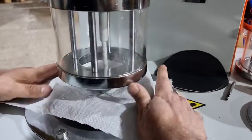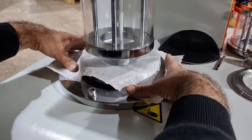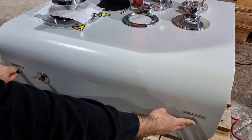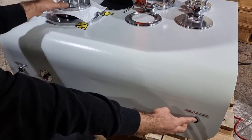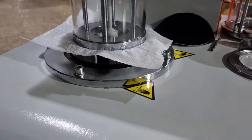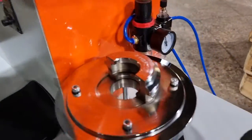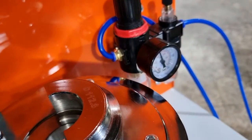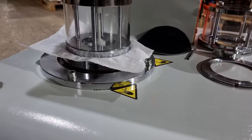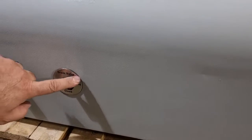First move it upward to put the sample piece — stretch the sample piece — and then you can clamp it. The clamping is pneumatic and the inlet compressor pressure must not be less than five or six bar.